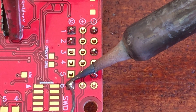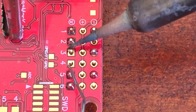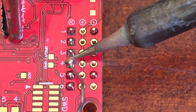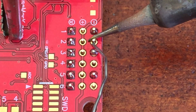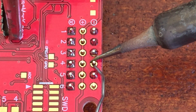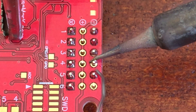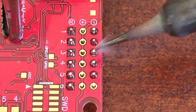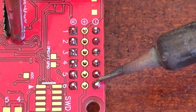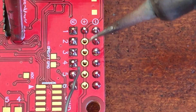As you can see I'm using a very fine tip soldering iron — that soldering iron should have been cleaned there. It's actually quite awkward trying to do this with a camera right over the PCB, so I look a little awkward, but you're watching this in real time and this is the actual speed at which you would solder. I've wetted the soldering iron a bit to get better heat transfer. The technique is: heat the actual surface, then dab just a touch of solder onto the iron — that transfers heat to the pin and the pad — and once it's heated up you can apply solder to it. I'll let you watch a few more in real time and then we'll speed the video up.